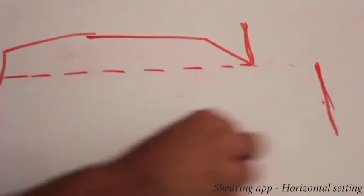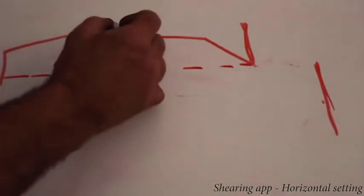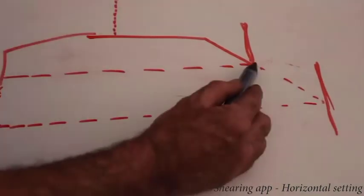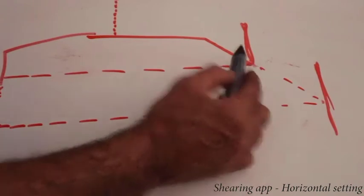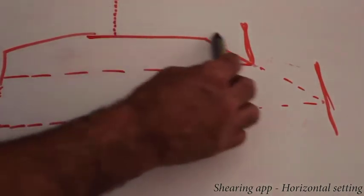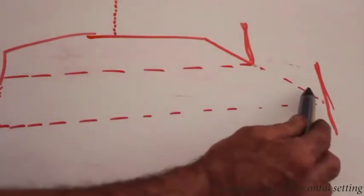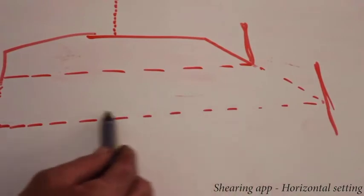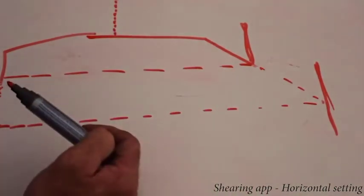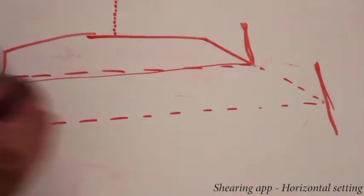And the cutter's only that long now. The pressure point from the pendulum was always in the same spot. The cutter got thinner. It started grinding more to the tips. Why? Because there's less steel above the pressure point compared to when the cutter was new. So the pressure point's closer to the tips of the cutter. Therefore, the cutter will go down to the tip as it gets thinner.